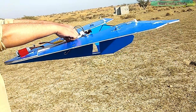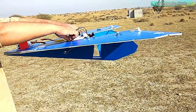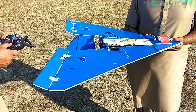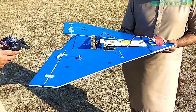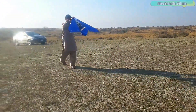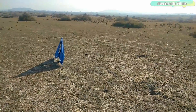After fixing the 2600kV brushless motor and other electronic parts and battery, I checked the overall weight of this RC paper airplane, which is around 630 grams. So a motor with over 1000 grams of thrust should easily lift it. Prior to the flight test I checked the center of gravity — it should be a little nose heavy. Never fly an RC airplane tail heavy. By changing the position of the battery you can change the CG. Finally I checked the control surfaces and the brushless DC motor using my Flysky FS-I6 transmitter.